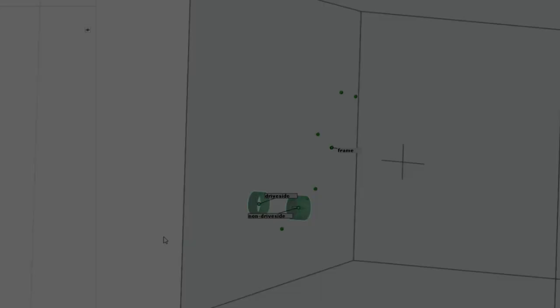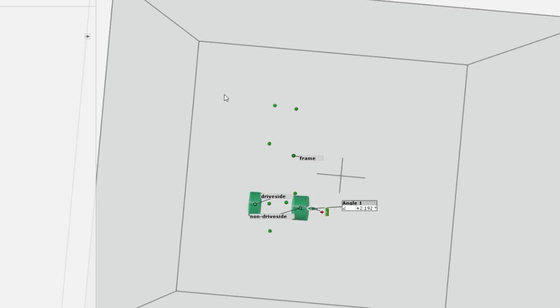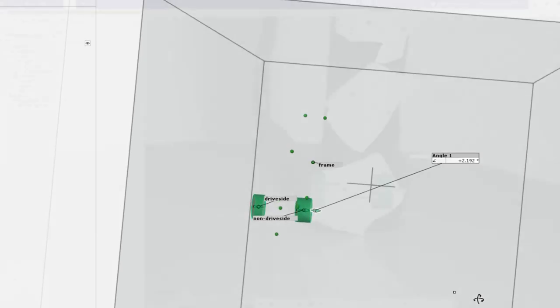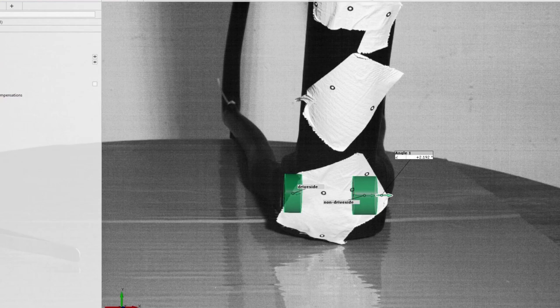The angular alignment error of the two bottom bracket shells was measured to be roughly above 2 degrees. Well, it could be that I didn't accurately measure the shells, as the threads didn't allow a precise placement of the touch probe tip. However, the deviation error of the point clouds, which defined the cylinders, was below a tenth of a millimeter. So if the misalignment is obvious either during the installation of the bottom bracket and the crankset, or during riding, I will order for sure a Hambini BSA bottom bracket, which is currently out of stock sadly.